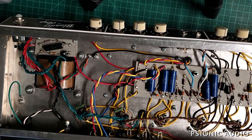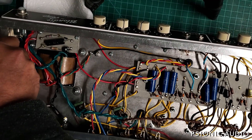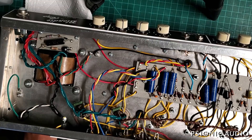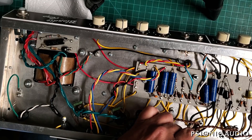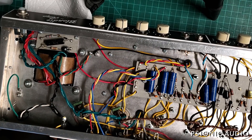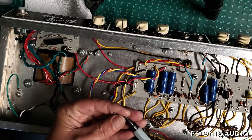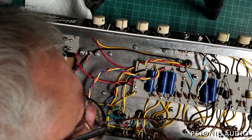Something I want to do - I've got this pretty Mercury power transformer in here with a red bell cover. I like to put a little paper towel between the bell cover and my work surface because my cutting mat always ends up getting little giblets on it - I don't want to scratch up the paint on that transformer. I'm feeling the inside hole and there's no rough edges, so I don't need to deburr. If you feel anything at all sharp, get in there with a deburring tool - it just rotates around on the inside and takes off that rough inner lip.